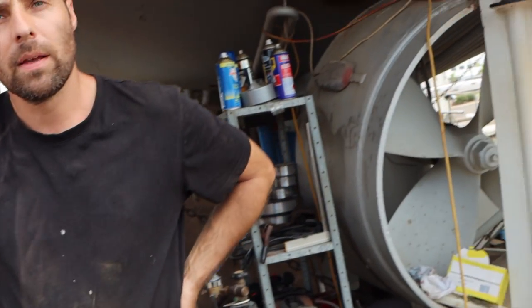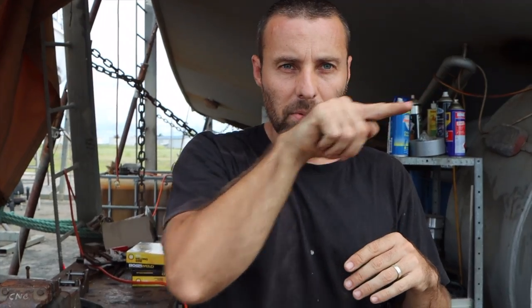What does that actually do? Sorry? This at the front, what does that actually do in terms of flow? As in like a smaller... A smaller pipe, yeah. It depends on the speed your wing is going through the fluid, whether it's water or air. You can have more curve on the top or the bottom if you've got a slower moving wing. You can have more round on a slower moving wing. A jet will have a really fine taper on the wing, whereas a slow plane like a glider will have much more curve in the wing and a blunter front edge.